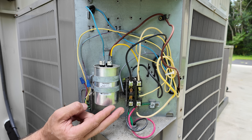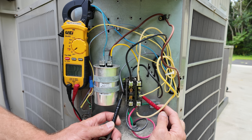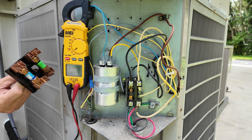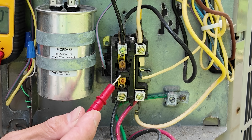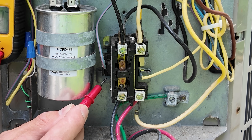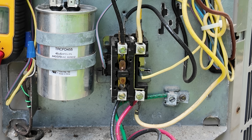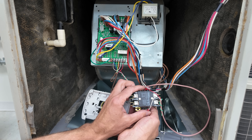These two components may be good and you may just not have any power. We can check all these items with a multimeter. In this case, we have zero volts right here — so even if the contactor was pressed in, because we have the power off, it's not going to turn on. The 24-volt power is meant to suck in this contactor via the electrical magnet at the bottom. When you power the coil of wire, it turns into an electromagnet and sucks in this contact, allowing your high voltage power to come through and turning on both your outdoor fan and your compressor.